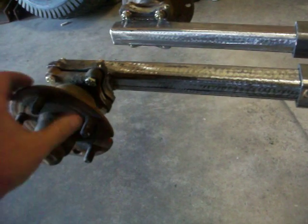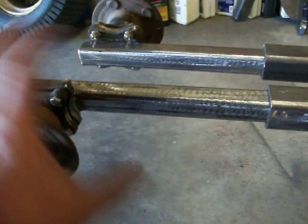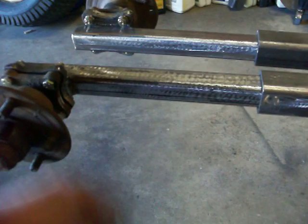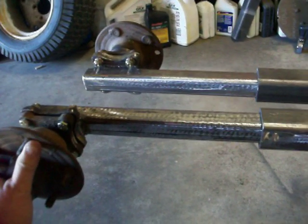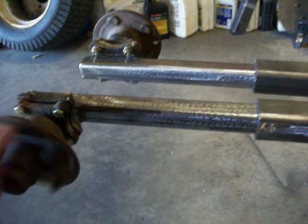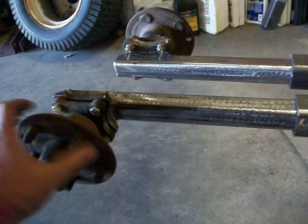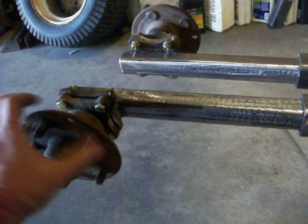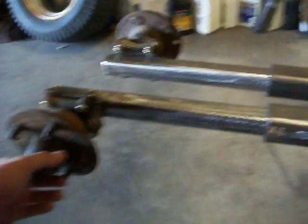Keep the track tight. You may have one track longer than the other, or a wheel a little bit out of round. When it comes around to the part that's out of round, it would tighten up and bind the track down — kind of like a minibike chain. That's why you need a spring-operated idler on a minibike, to give and come back and forth. It would be the same thing here.